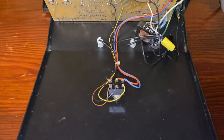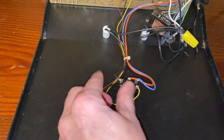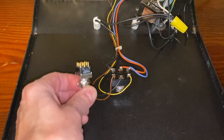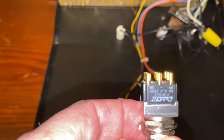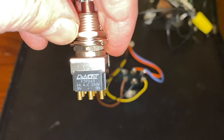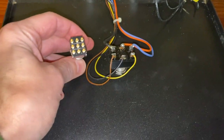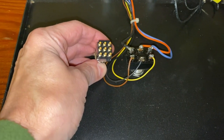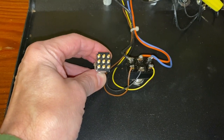Just a quick lesson on these switches. This is a two-pole double throw switch, and basically when you throw the switch, it connects these or these depending on how the switch goes. I'm replacing it with a three-pole simply because it's the only one I could find. You can take a peek at what this is just in case you want to look it up — pretty hard to find. This is a three-pole double throw, and you can just use the six lugs there. And by the way, if you want to hook up an LED or something later, you could probably do that using the other poles.